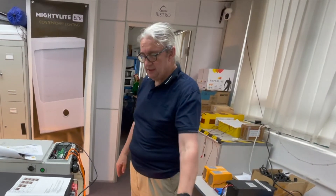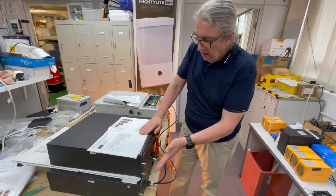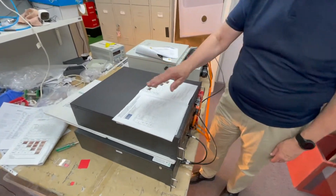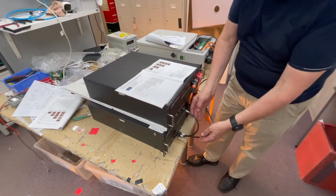I've got two batteries here and these are set up the same as the SunSync one — the SunSync is very similar. Make sure your batteries are talking to each other. On the batteries, you have dip switches. If you look at the manual, it will tell you a master and a slave. One becomes master, the other slave, and you have your connection between.